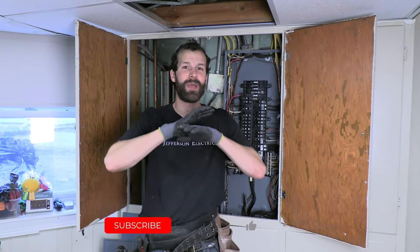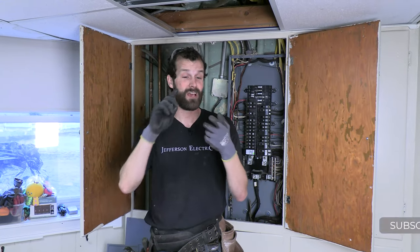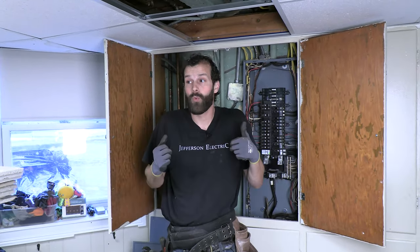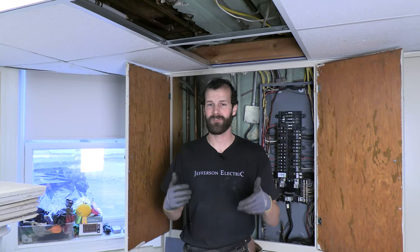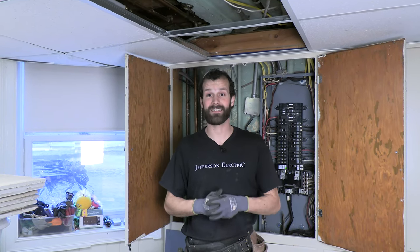This project applies to any basement receptacle you might install for any type of appliance — washer, dryer, fridge, freezer, sump pump, grinder pump, general use or other appliances. When do you want a dedicated circuit? If you've got a power-hungry device, or if receptacle failure or tripping could be catastrophic — such as a sump pump for your basement — you'll want a dedicated circuit.